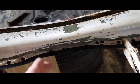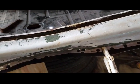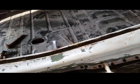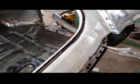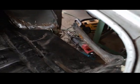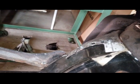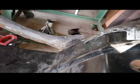I could make it tight, but that means I'm moving metal, and I really don't want to move metal to make it flush, because then that means something's going to bow and give me a problem down the line. So that's, again, temporarily installed. Let me show you the inside here. I did the same thing. Holds the quarter panel in. That's going to get removed, so it doesn't have to be pretty now.